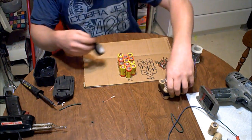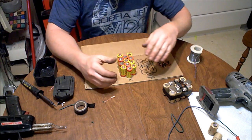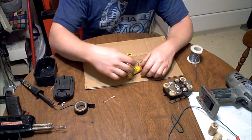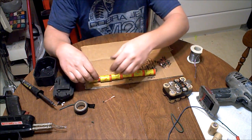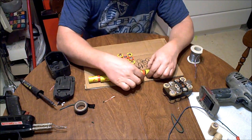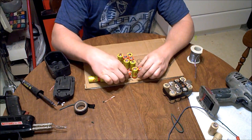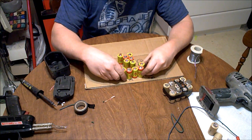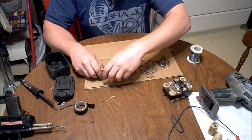These are all NiCad. Before I tape this together, it looks a little confusing and daunting but it's really not as bad as you think. Essentially all we're doing is putting all these batteries in a straight line — positive, negative — just like they would go in a kid's toy. The problem is that doesn't make a nice compact battery pack, so to make one touch the next we're just folding them over, and where that one touches the next we fold again, and so on. This is all we're doing, but then we're also layering them together to make exactly the shape we need.